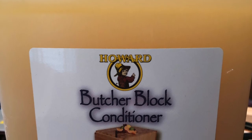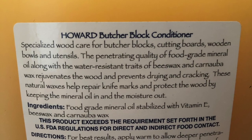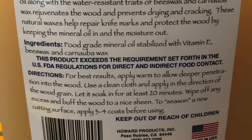Hi and welcome back. In this video segment we will be completing the cutting board possum box woodworking kit, and to complete it we will be applying an oil finish to the cutting board. I've attached some pictures of the oil we will be using. That oil came in the small container that was part of your woodworking kit. I will actually be using oil out of the big container here, and I'm going to apply the oil simply with a paper towel, applying three to four coats of oil over time.